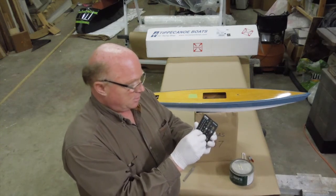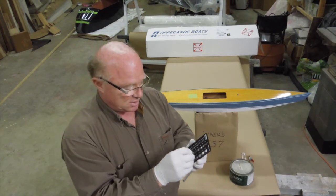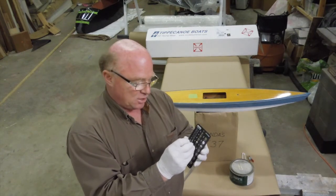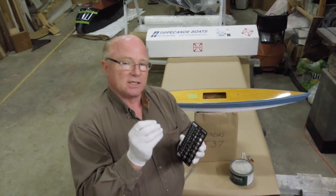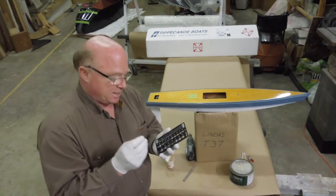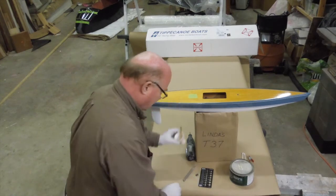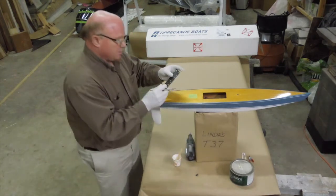I'm going to cut out my masking on the top here one size up, and that's 21/64 of an inch. I could go a little bigger still. But anyway, the point is that I'm going to make a little bit extra size hole in my varnish when I sand it away so that I can put a meniscus of epoxy on there. And that's going to give me a little bit of extra bonding area. All right, so this is a steel gauge. You don't absolutely have to have it. And this is my pre-mixed epoxy. We are going to use that.